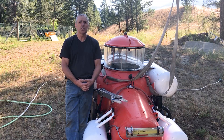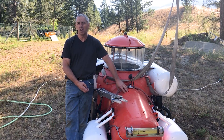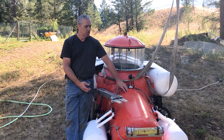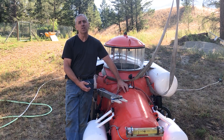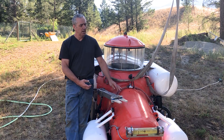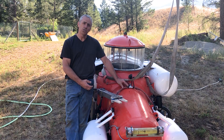I have made some structural changes to it though. I've added some electric penetrators — I've had to drill through the hull and add them. And I've had the acrylic cylinder off and on a couple times. So it would be prudent to do a pressure test. In a couple days, I'm going to run out to Cooney Lake with it, weather permitting, and do another unmanned pressure test. It just takes a day, and then I have peace of mind and I can start diving in the lakes. No problem at all. Nothing to worry about. So ciao for now.